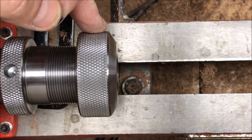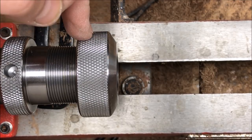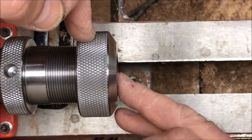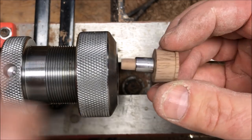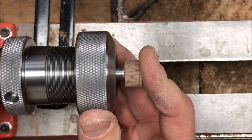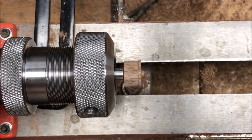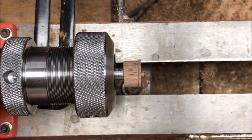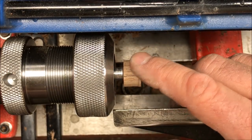I'm going to use a collet chuck for this next part, but after I use the collet chuck I'll go back and show you an alternative way to make this finial without having to invest in the collet chuck. We're going to slide a 7mm bushing onto the shaft that we created, slide that into the collet chuck, and tighten down the chuck. We're going to turn this little block of wood down to the diameter of our bushing, but I want you to turn it a little bit fat — I'll show you why.